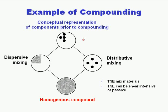A brief description of what a twin-screw extruder does. The top figure here is an example of a conceptual representation of what goes into the twin-screw extruder. We're generally performing distributive mixing, where the materials are moved around spatially but not broken down — this might be common for a natural wood fiber, where you want to mix the fibers around but not break them down. We also may want to perform dispersive mixing, breaking agglomerates down into finer morphologies. Generally, the goal is to get a homogenous compound at the exit of the twin-screw extruder.